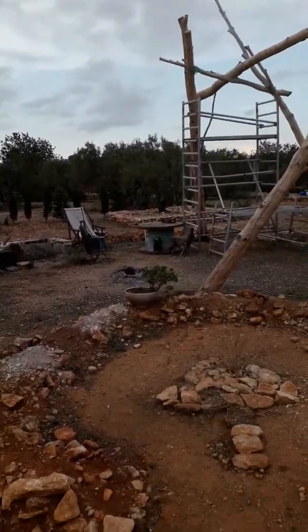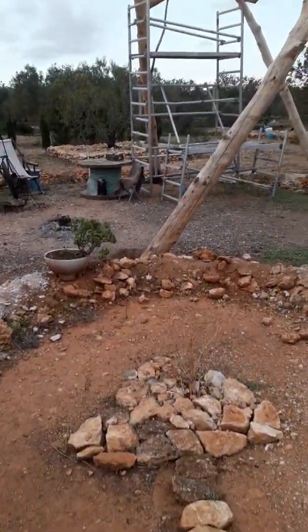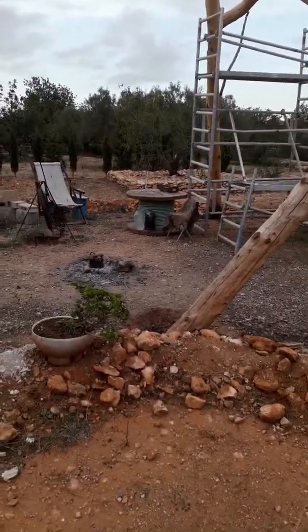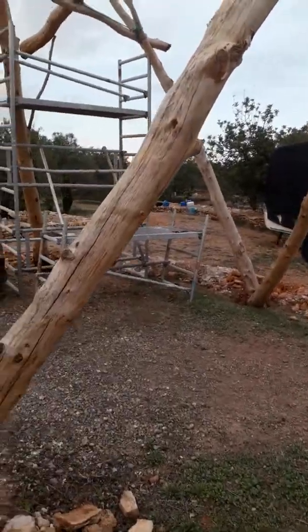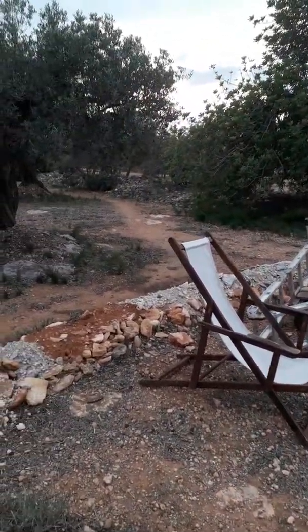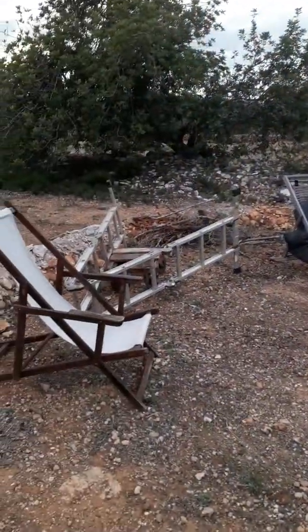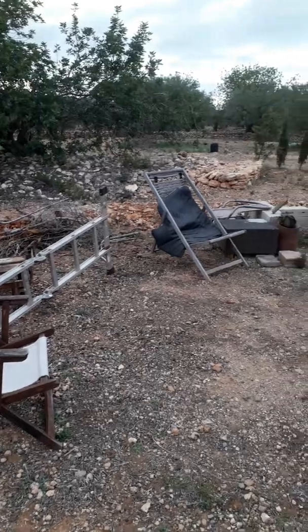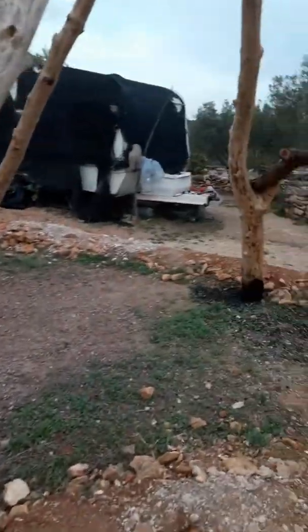This is going to be the entrance to a house. I'm going to walk in through in the direction of north. This will be a porch area, and there will be passive solar windows here and a doorway going in on either side. It's only one space — a circular room which has been made into a crescent. When I've got my walls up, which hopefully are going to be straw bale all the way around the outside, you'll get a big space that's naturally partitioned because of the crescent shape, so this area here would be slightly invisible to this area here.